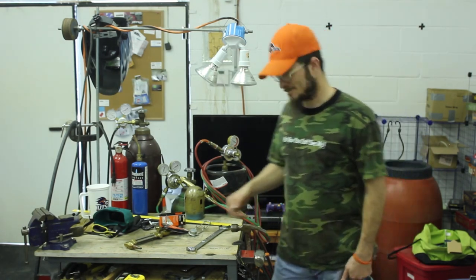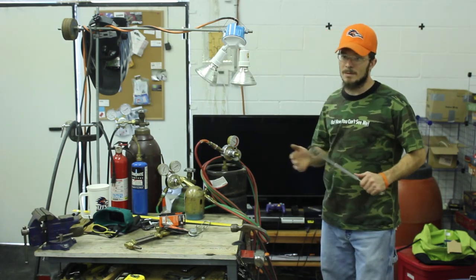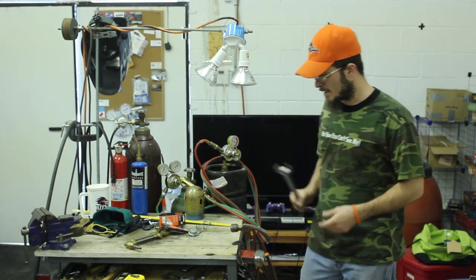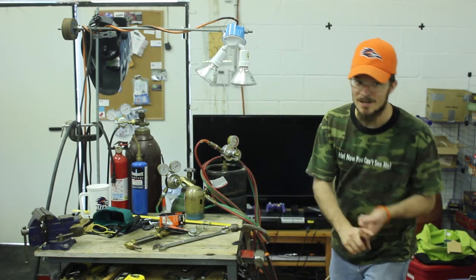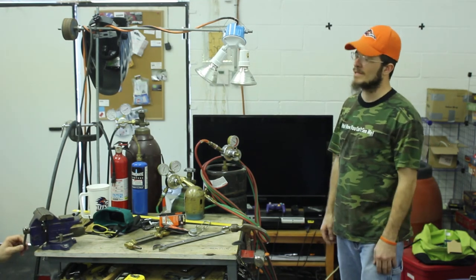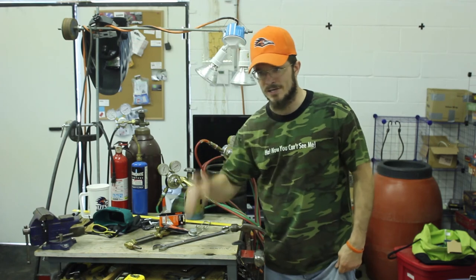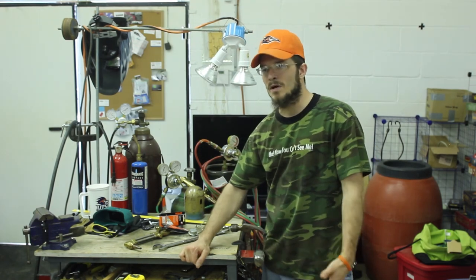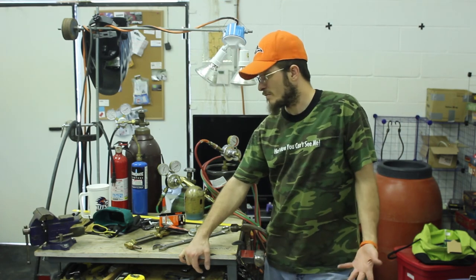I'm sure you've covered zinc safety already. I haven't yet. That's something that maybe we'll do real quick. No, we'll do it right now. Zinc? Okay, so there are interesting arguments out there that zinc is not immediately deadly. However, zinc is not good for you. There's no doubt that it is not good for you. What do they call it? Zincidosis or something. I mean, you don't want to breathe the galvanized coating on galvanized metal.